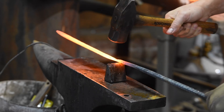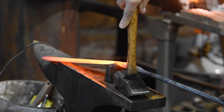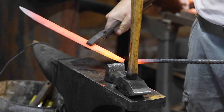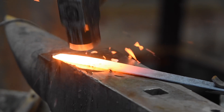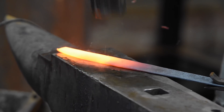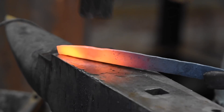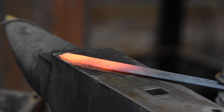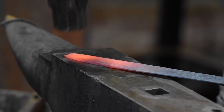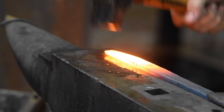Once I get to the point where I need to start working the tang, I'll hot-cut the blade free and do the rest holding it with tongs. For those not familiar with the construction of Japanese blades, Japanese blades are forged so that the bevels extend all the way through the tang. Japanese sword furniture is made to slip on and off, not only so that it goes in and out of a scabbard, but so that the handle can actually be pulled off and a new handle put right back on. By having the blade carry on the tapers of the bevels, it just makes it easier to take that handle on and off and to replace it.